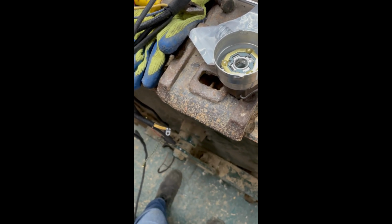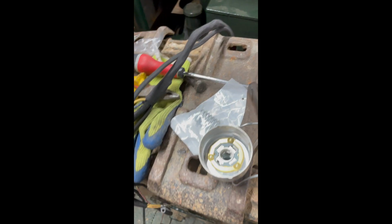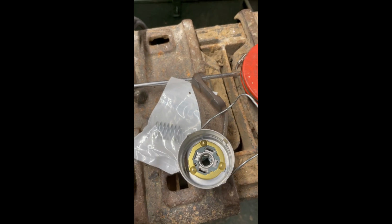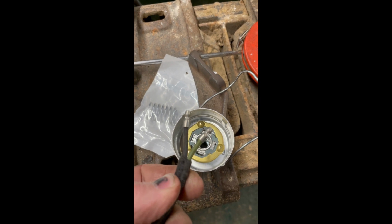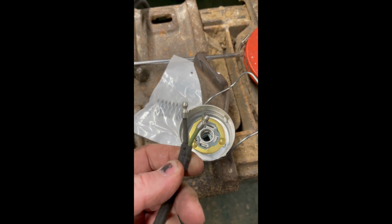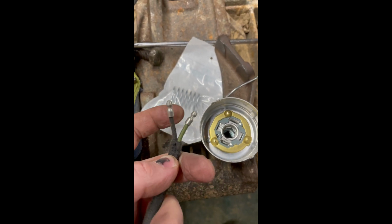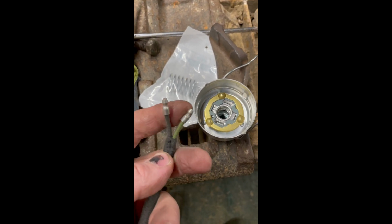And when you rev the engine, which it would normally be because it's a tractor, because it'll be working, it's working RPM, it'll be generating and recharging the battery and powering the lights, or vice versa, just doing the charging. So this is the power lead effectively that's going to go to the battery. The negative on the battery, remember, not the positive, because the positive is the earth.